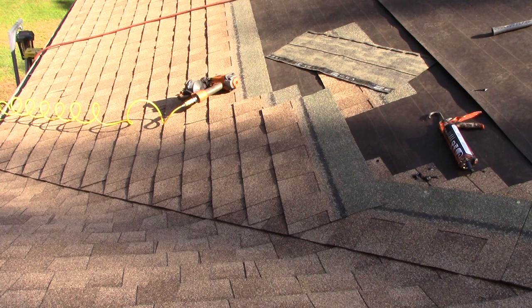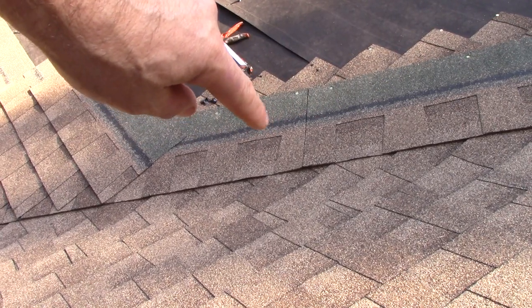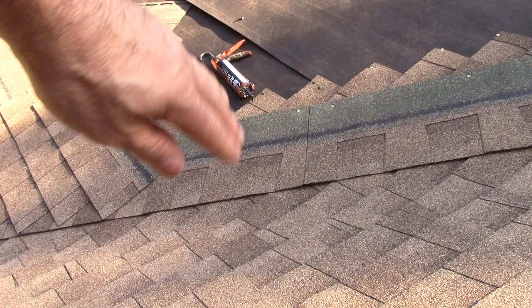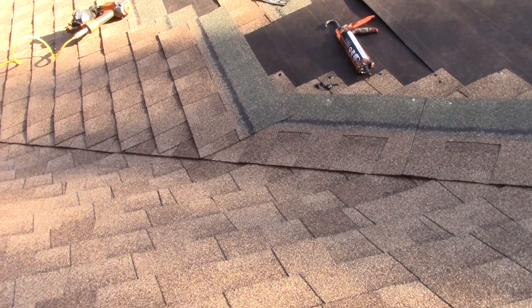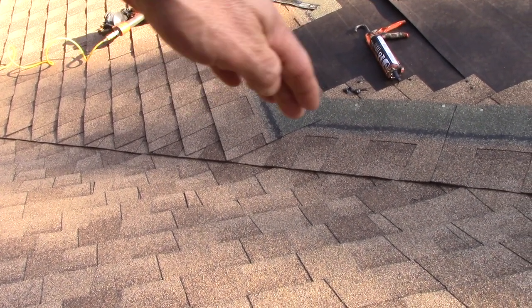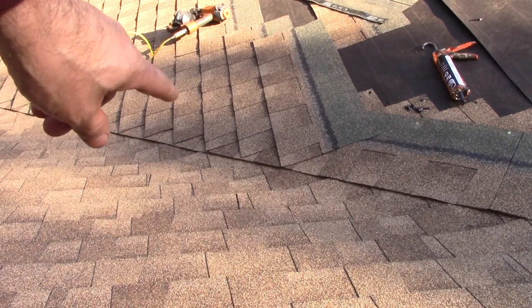Maybe one other thing: if I get to a seam here where two tiles come together, even though there's a bead going that way, I would lift those two corners up and throw a little tar in there just in case, wherever the tile comes across the shingle. I'd throw some tar there just to be sure. For a novice roofer it's the way to go — no worrying about cutting into this valley or getting your angles. You can't tell there's a vertical course there; it just blends in real good. Anyway, thanks for watching.